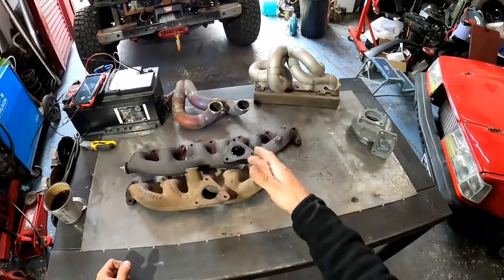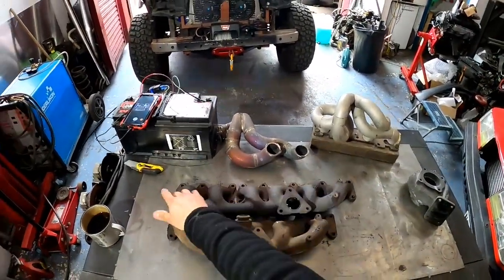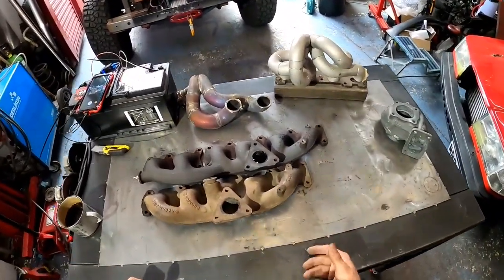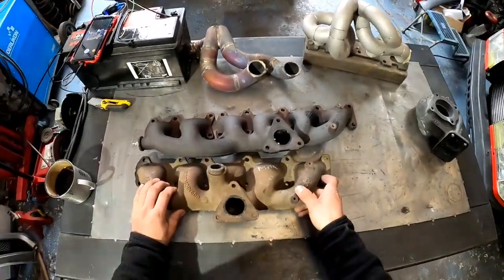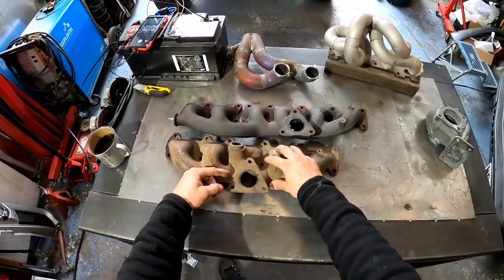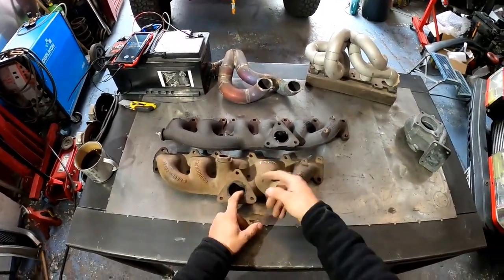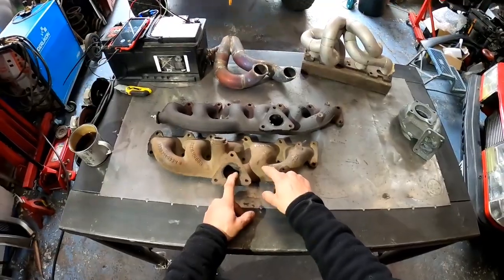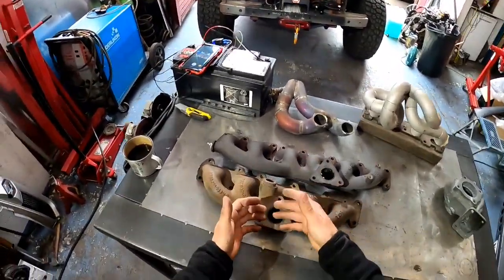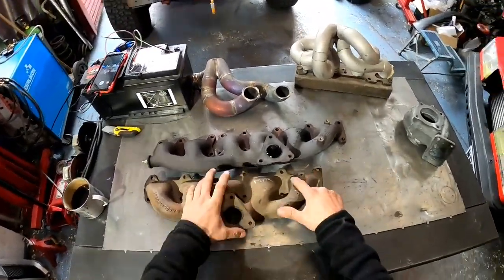And this is exactly how you build the exhaust manifolds, even the tubular ones. You separate the 2 scrolls, they're separated by the firing order, 1, 2, 3, 4, 5 and 6. So this actually works pretty good. And that way, in the 4, 5 and 6, all 3 of them kind of go in one direction, and there's nothing actually to stop them. So they all flow into one direction towards the flange.